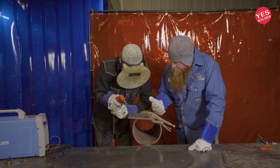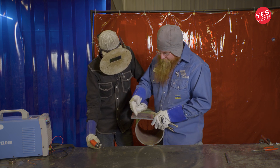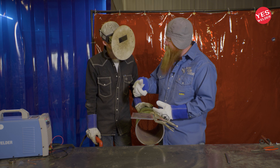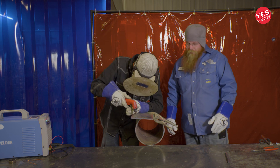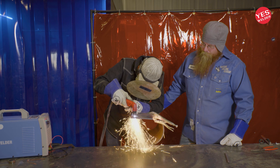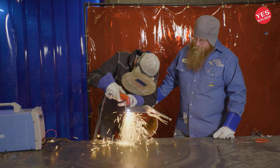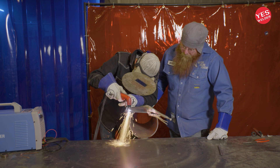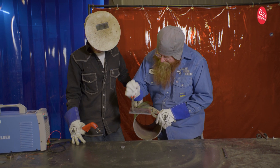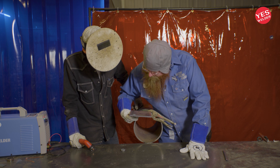Now that you already got that pierced, you can start on the edge. When you don't have a hole started you want to start in the middle — that way if it messes up, you're not ruining your edge. Once you're on the edge you can start right there. Try not to be jumpy — that's just like welding. If you're steady it'll be a nice clean cut; if you're not steady you'll get a jagged cut. You can just knock that slag off the bottom — look at that cut, that's nice.